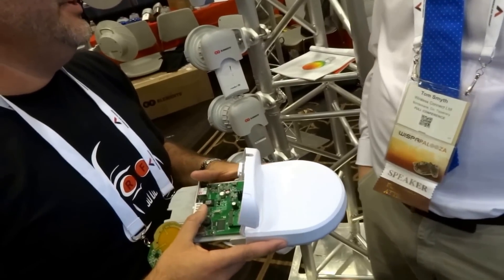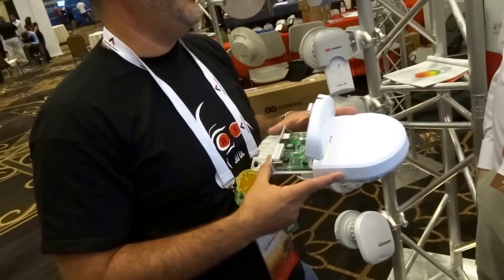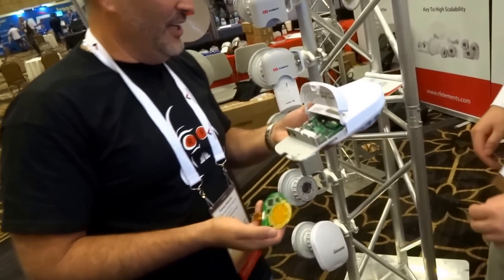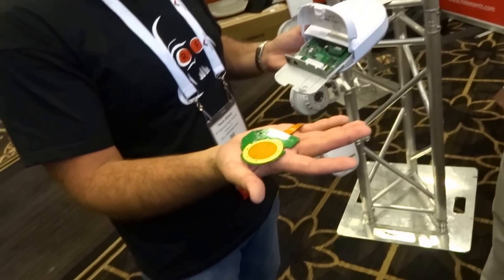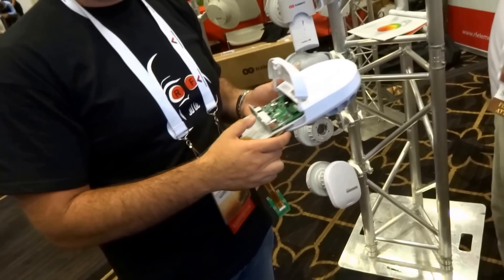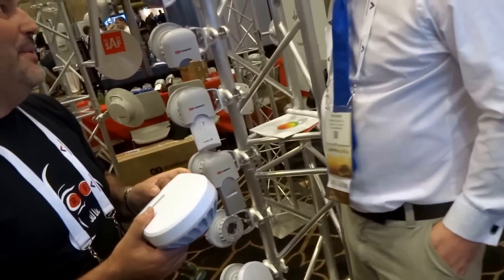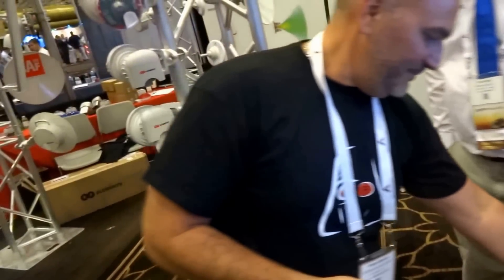We have performance data showing this radio surpasses some competitor radios. It's targeted towards MikroTik so you get to use RouterOS, but the radio itself is vendor neutral — if another board has a mini PCI Express interface, you'd be able to use it. Everything comes in shielded or unshielded, except the ePMP 1000, because that radio itself is already shielded.